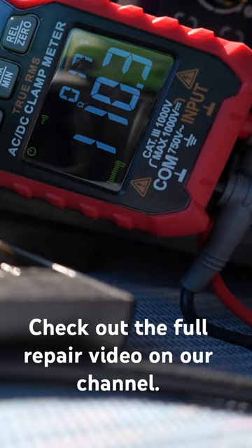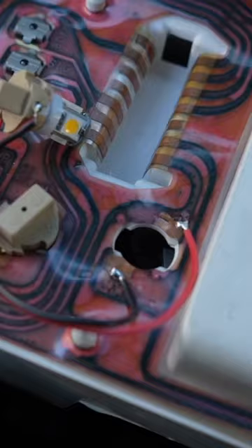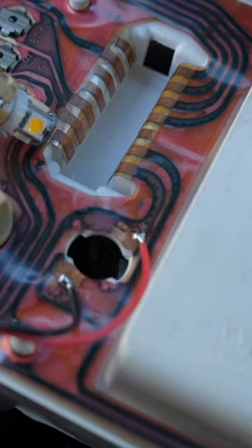Now you've really got three different options to fix this. Option A is the dirty one — bear with me — you just solder the socket to the back of the gauge cluster. You're not getting that bulb out ever again, but why would you? That's the next guy's problem.